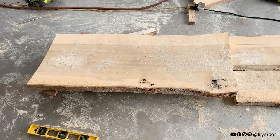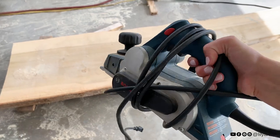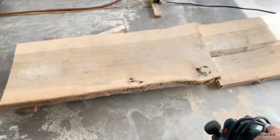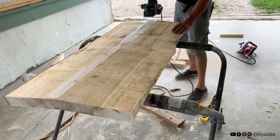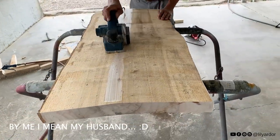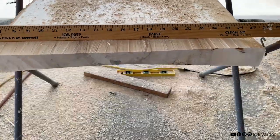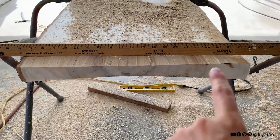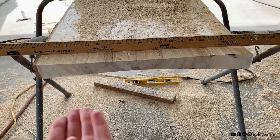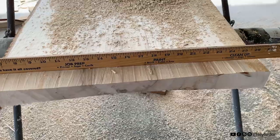The wood is all cut for the tabletop. Now I am going to use my hand planer and see if I can flatten this wood out a little bit. We actually got it down pretty good. This was the side that was bowed. We're just going to flip it over and take these edges off, and that's it. We're not going to touch the center at all.